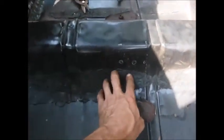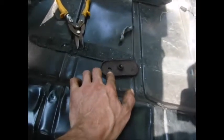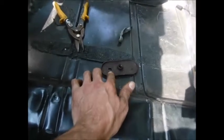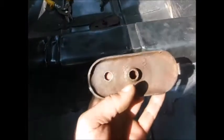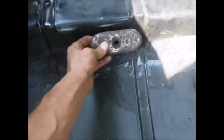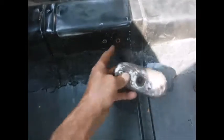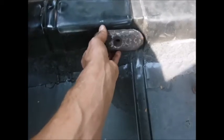We got the spots marked on both sides. This one here already had a hole rusted through from the spot weld, so we just utilized that and rounded it out. A lock washer and bolt on the underside - as long as this is secure and the hole stays lined up, I can put the seat belt bolt back in. This piece won't pull through - there's no way.